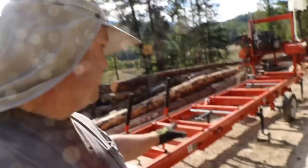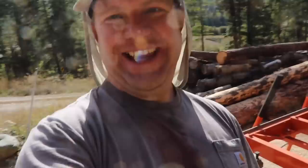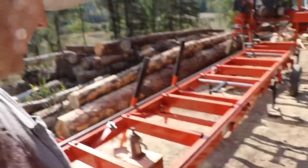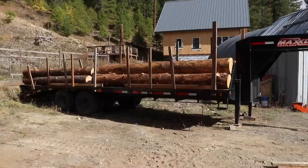This is only the second time I've used the sawmill on the trailer, so it's kind of weird — the mill head is at the other end from what I'm used to, and we're milling in the opposite direction now. The height of the sawmill is also different. Before it was very low to the ground, which made it hard to see underneath for jacking taper in the logs. We're going to use a borrowed bottle jack to adjust log height at the mill head to take out the taper and get a nice straight cut.